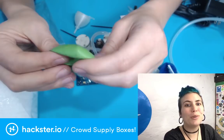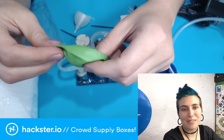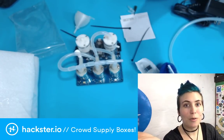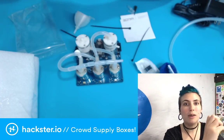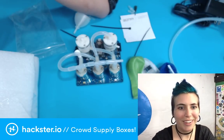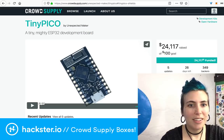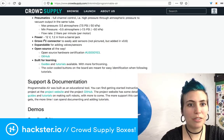And you can use it to create a really cool kind of gripper where you fill a balloon or a nylon stocking or whatever with coffee grounds. When it's at neutral air pressure, it's just floppy. But when you suck all the air out and create a vacuum, then it conforms around whatever object is up next to it. I'll just show you the video. You push a marker into the balloon, and it will conform to that object and pick it up like a universal gripper.